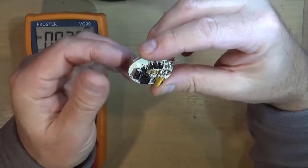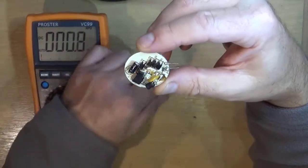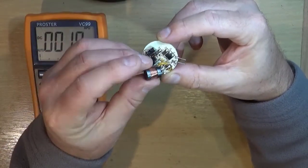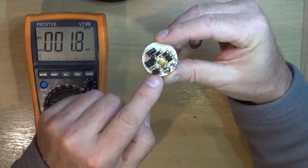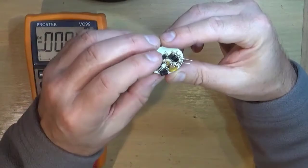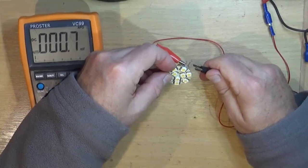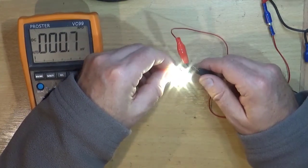This one is faulty, and it got even more faulty as I took it out because there's a little inductor there and I broke it off. So I ordered another inductor which worked, but found it didn't fit in the light fitting because it was too big. So I bought some more inductors which are nearer the size of the originals, and now it's working.